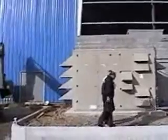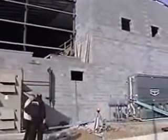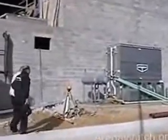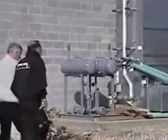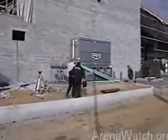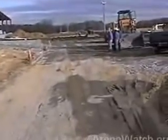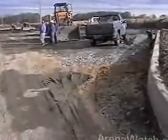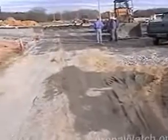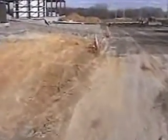Here we're in the back of the building, showing the dehumidifier. Masonry's up all the way. We've got our evaporative condenser and receiver skid in position. Getting ready to place the asphalt in the back here. One thing that's real critical, because it's November, is to get the asphalt down before the hot mix plant shuts down. Most of them will be shutting down in about a week.